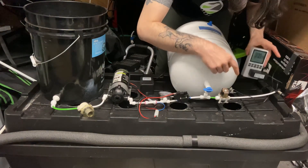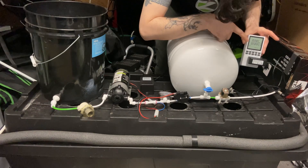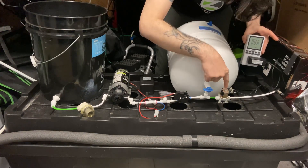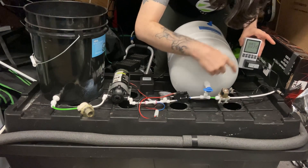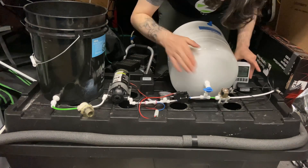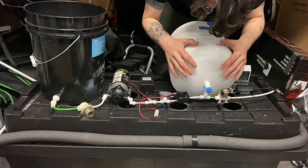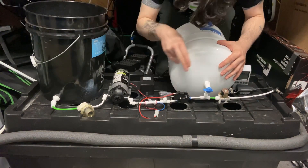The recycle timer is set to your desired timing. I started with 3 seconds on for every 3 minutes off — I never go over 3 seconds on and no longer than 5 minutes off. This timer controls the solenoid, which is normally closed. When it gets 9-to-12 volt power, it opens, the pressure from the accumulator comes out into the chamber. When the pressure and liquid drop below 80 PSI, the pressure switch kicks the pump back on and the whole process repeats.